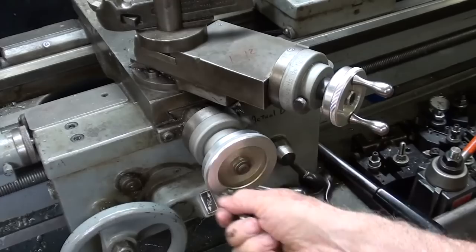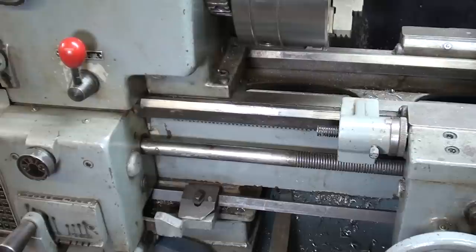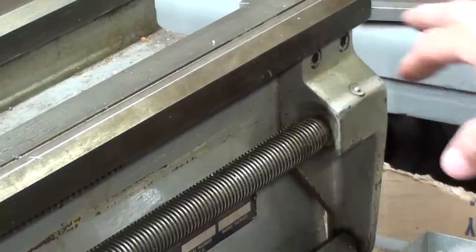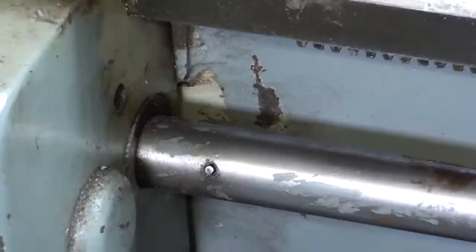This is my Clausing 12-inch lathe. If you're feeding out under power and come to the end of the screw because you're inattentive, the cross slide reaches the end of the screw and you would have to re-engage it. For automatic longitudinal feed, you can see that Clausing used an almost incredibly robust bearing on the end of the lead screw. What they've done on the Clausing — and the Logan, and probably many other makes — is use a shear pin right here.